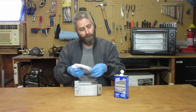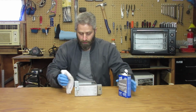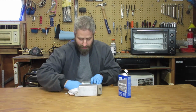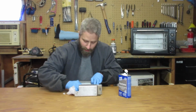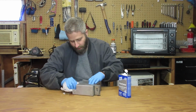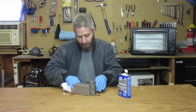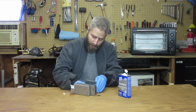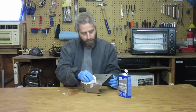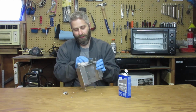But I would advise anyone looking into powder coating to take the time to clean your piece to the fullest, because any grime or rust, and in some cases certain types of paint, will not only cause the powder to not stick, but could cause other issues during the baking process. So that's my advice. You notice I'm wearing gloves when working with acetone.